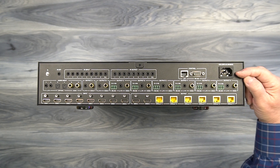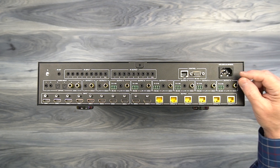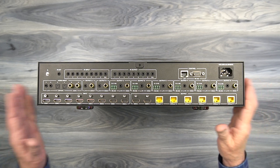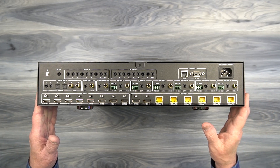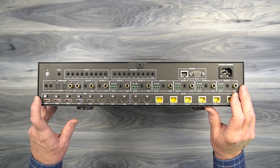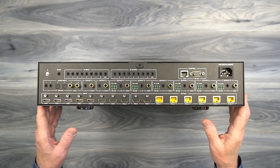Finally, there's an AC input port that's used with the included cabling — plug one end in here and the other end to the nearest AC outlet, and that's all the power you need to operate the product. Because this product provides power over cable technology, once you power up the transmitter all the power required for your remote locations is sent over those same LAN cables, so you don't need a power supply at the remote locations.